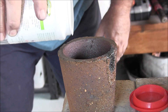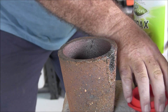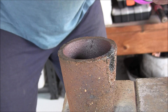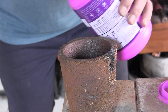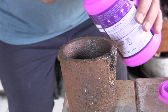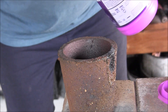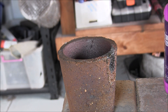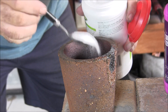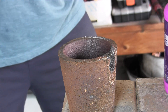I'm going to drop that into the bottom of the crucible, and I'm just going to add some borax — I'm not even going to measure it, just whack it in there. And also some sodium carb. A little bit of a light mix up. A bit more borax for good measure. The more borax you put in, the more liquified it becomes, which is what we want.